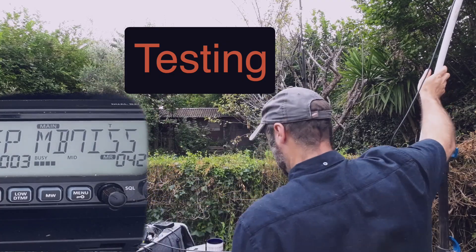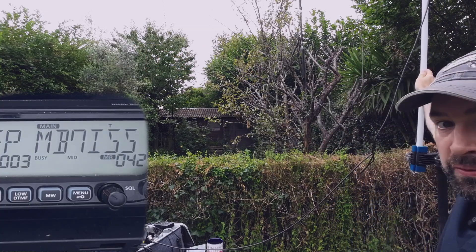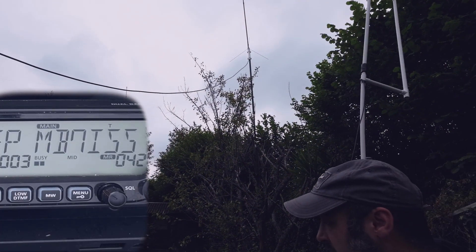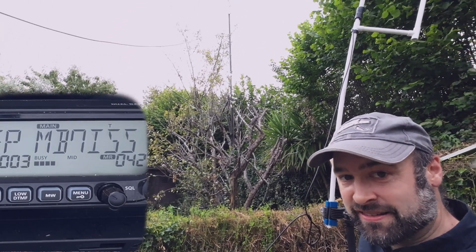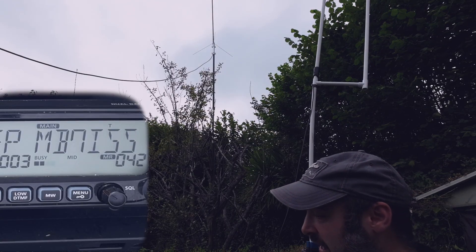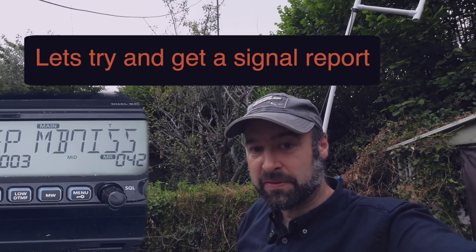I'm getting four bars now. I'm just about to turn the antenna. As you can see, with the back end facing towards there — let me turn it around, watch the screen — we're getting four bars. I've got it quite high because this is a weak repeater; it's quite far away. There's a bit of wobble on my PVC pipe, but you can see the difference it makes when I turn it. We are blocking it, and then when I turn it around, I definitely get a bit of gain. I think something is working there.